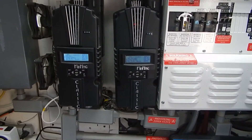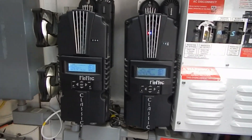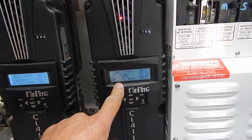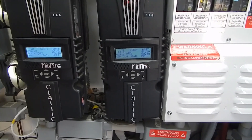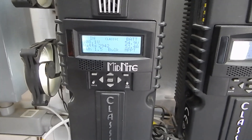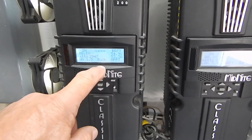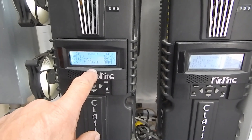We just got all the solar panels connected. We turned on the 370-watt bifacial panels and had 3000 and change a moment ago on one controller, and 3000 and change on the other — that's 6000 watts of solar coming in. I've never had that much power. You can see 2942 over there, and with just the bifacial panels we had 2022 watts coming into the Midnight. That's 370 watts times six, plus three 395-watt panels hooked up to the 200. That's fantastic.